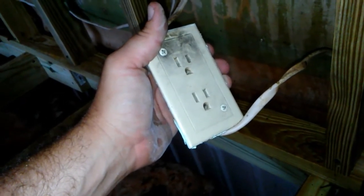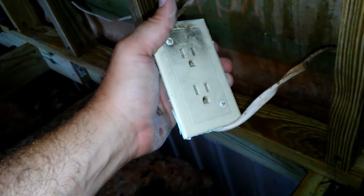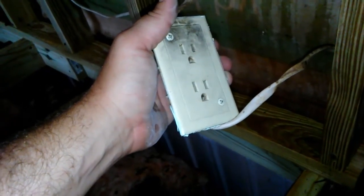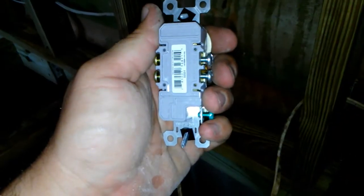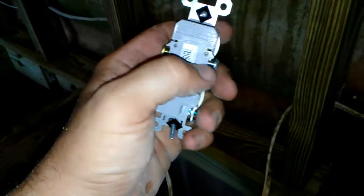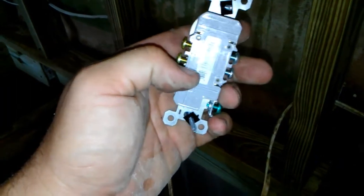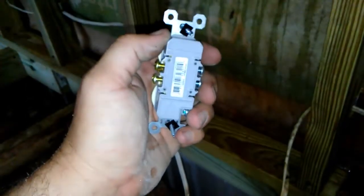Here's why: duplex outlets are more expensive. You can buy nice quality standard outlets that are cheap enough. If you're going to do this, or have somebody do it, I also recommend not putting the wires through the holes — even though it's perfectly fine, acceptable, and to code. Take a little extra time, curl your wire and put it around the screw terminal. It gives a much better contact than just that little blade bite.